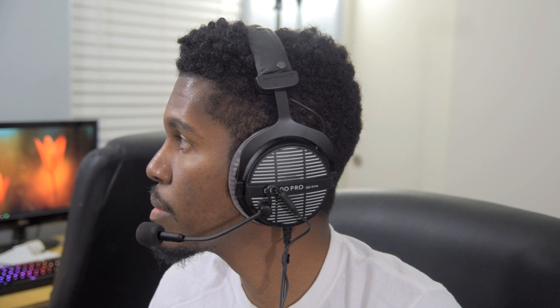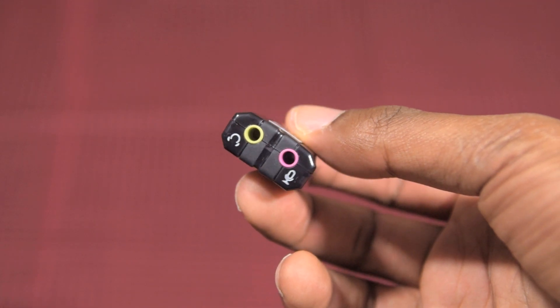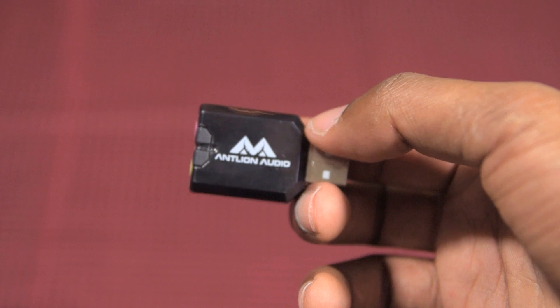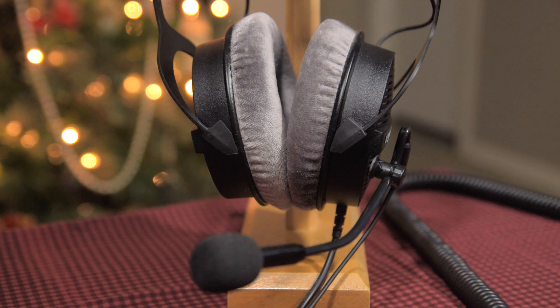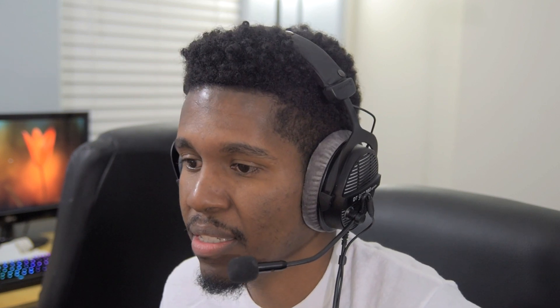With the mic test complete, I can finally give you my thoughts on the new ModMic 5. The mic quality is definitely a step up from a typical headset — even in the unidirectional mode it sounds much more full and less nasally than most headsets, and in the omnidirectional mode there really is no comparison. I did have to go through some things to get my mic quality up to par. First I had to use the USB adapter, or sound card — without it I got a crazy amount of hiss from my onboard audio, so I'd highly recommend purchasing that for most people. Also I was getting some feedback in my mic — a hum or buzz — which turned out to be caused by my surge protector. Turning that off fixed the issue, but tracking it down was frustrating. Apparently I have some kind of dirty power issue in the office and the mic was picking up on it — not the ModMic's fault, but worth mentioning in case someone else has a similar experience.